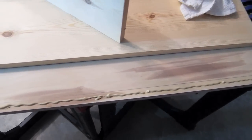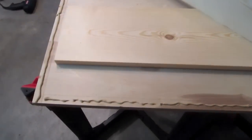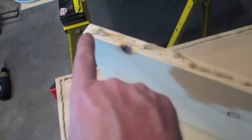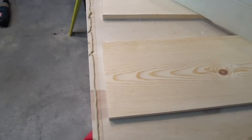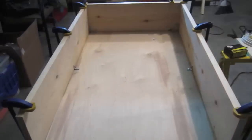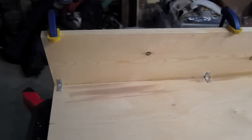In this first step I'm working on the base. What I've done is measured off three-quarters of an inch all the way around the frame of the base — that's the thickness of the boards. I made sure the boards are cut to the proper length, cleaned these edges with a rag, and applied a bead of liquid nails. On this first back piece you'll see the bead applied. The next step is to start setting them into place and clamping them down.